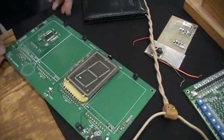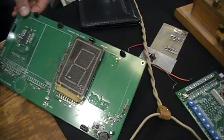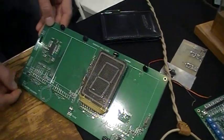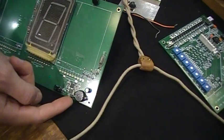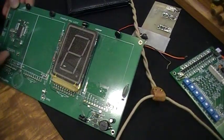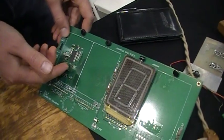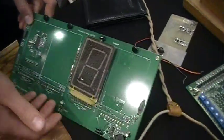And this is the circuit board. Did you build this circuit board yourself? This is my own design. Well, there's a high voltage power supply that takes the voltage coming in and it steps it up to 180 volts to run each of these displays. Over here there's a microprocessor that generates the multiplex signal to control each one of these display panels.